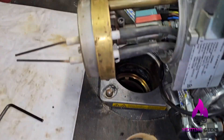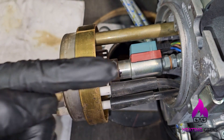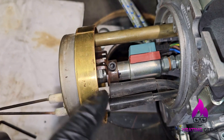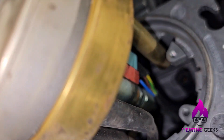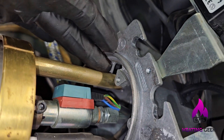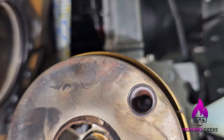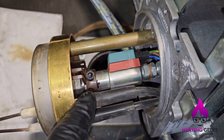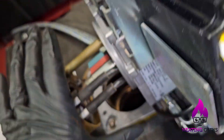If you look there you can see the sharpie mark. I marked that — where the line with the sharpie sticks out is exactly where that bolt was when I took it off to check the nozzle. I've put it on a different location. That tube — it's called the sight tube — that lines up with the sensor, which is right down there. With it now lined up in the new position, the sight tube is perfectly in line with the sensor. I think that might be what the problem was.